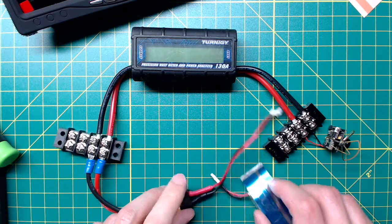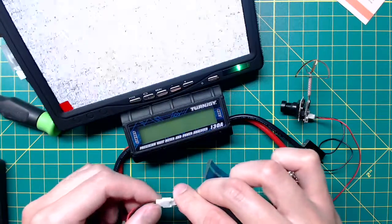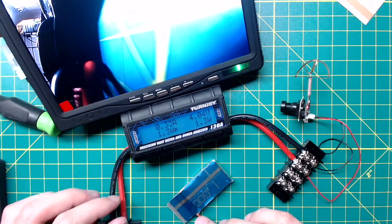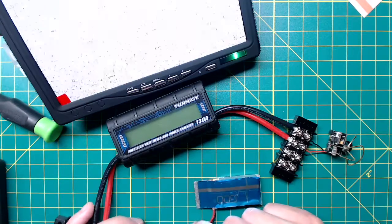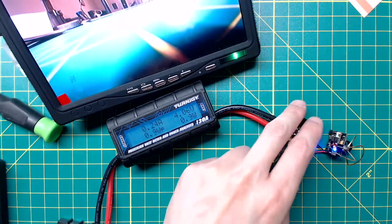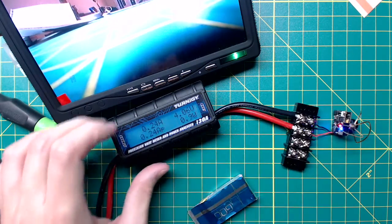Let's compare the actual power consumption of this camera. In the first test, I used a one-cell LiPo battery. For the EF01 at 4 volts, it draws about 330 milliamps. For the FX798 at the same voltage, it only draws about 230 milliamps.